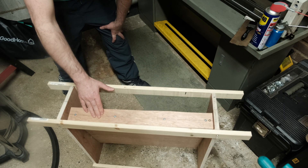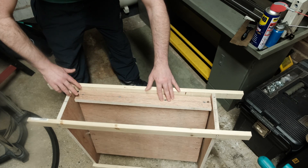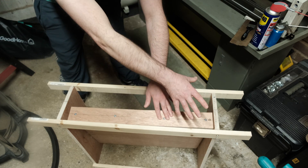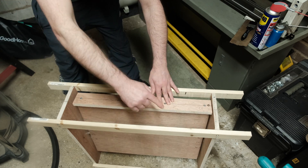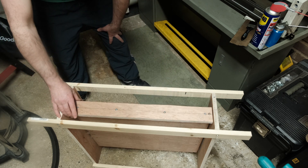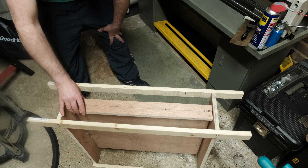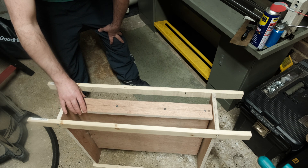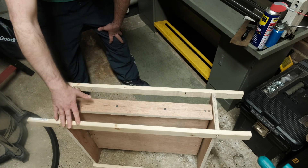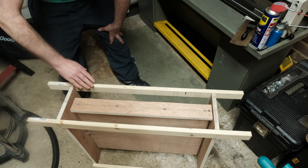As this rocks back and forth, one end will rock at 10 inch radius and the other end will rock at 12 inch radius. So as you move the router along, it will do that automatically — it will slowly get flatter and flatter as it comes to the 12 inch end. You can increase that and do a 10 to 14 if you like, though I probably wouldn't go too far. Or you can just put the pins in at one set radius — nine and a half, 10, or 12 inches — and just do it at the same radius across.